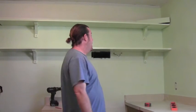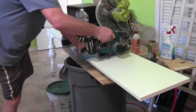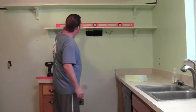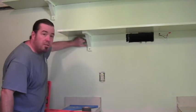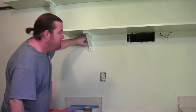Now my walls are really out of square — 1963 house. So you may choose to 45 your corner, but I think it's going to be best if we butt the two corners together just because the walls are so far out. If I can't get an exact 45 on that it's going to look funky. Now let's find out where I have to stop for the fridge. I'm leveling straight up from the edge of this cabinet — level it up and mark it. Use your square to get a nice clean cut. Cut side goes to the wall. Now that I got my shelves level I want to secure the shelf arms to them. I'm going to secure the arm to the top with an inch and a quarter wood screw. We also want to get one up in the top of the arm here that we can woodfill and paint over — that's really going to give it the stability it needs. Also throw another one in the back.